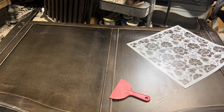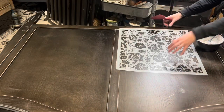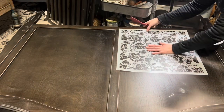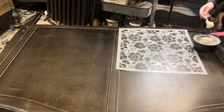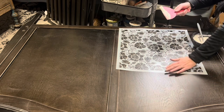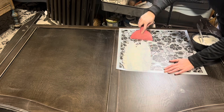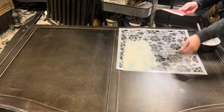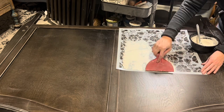When working on these larger areas they're kind of a pain because you have to wait for the stuff to dry. This joint compound is the 20-minute version, so it doesn't actually take 20 minutes to fully set up, but you can give it about that amount of time before you can start working on something else. I get my stencil lined up, do the flat areas first — that kind of sticks it down like tape and holds it in place.